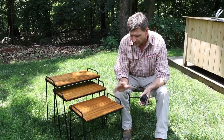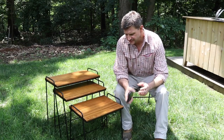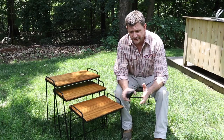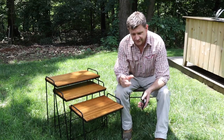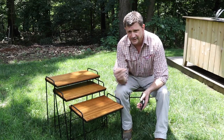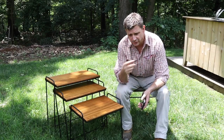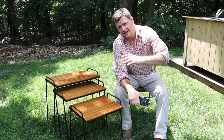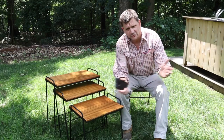When I was finishing the Sapele tops, I used something called nailers — those are little blocks of wood with screws going up through them. If you're not familiar with them, they're super handy. It's basically a piece of three-quarter-inch wood with an inch and five-eighths screw, and I like to drill and countersink the head of the screw so the bottom of the wood is flat. If you've got a down day, go ahead and make some nailers because you'll always use them.